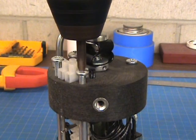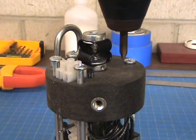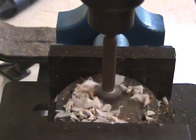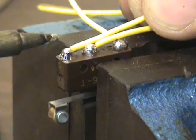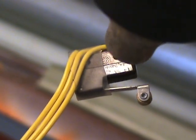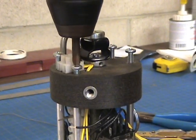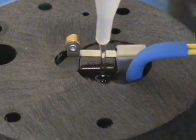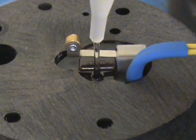To fix this problem, I removed the top of the Apogee detector, removed the steel bearings, drilled out the old switch, which was encased in epoxy, soldered some new leads to a new switch, put some heat shrink tubing on the switch to strengthen the hinge area, and reinstalled the top section to the Apogee detector. Here you can see I increased the size of the hole in the fiberglass tubing from 3/8 inch to 3/4 inch. This and the reinforced wiring jacket should do the trick.